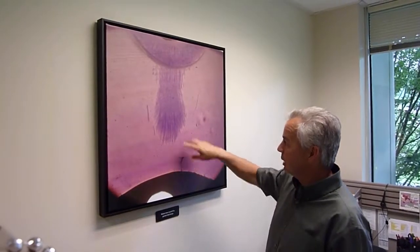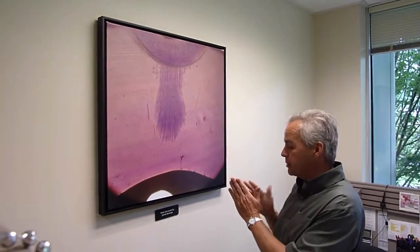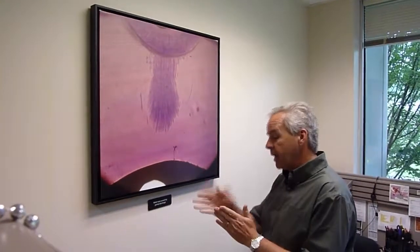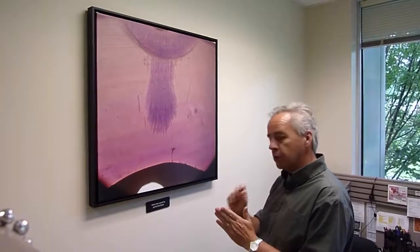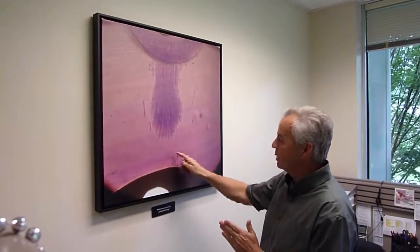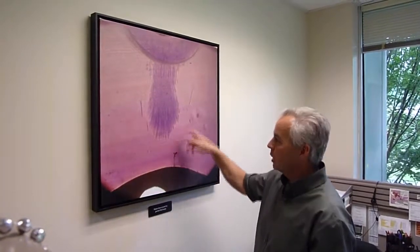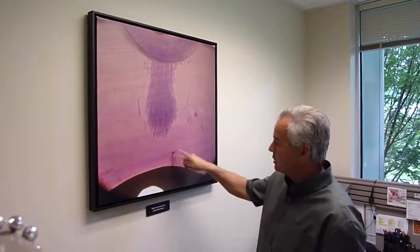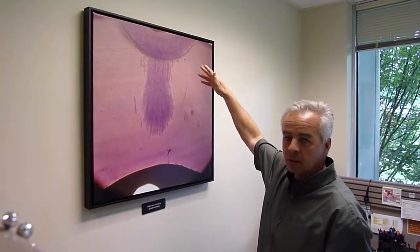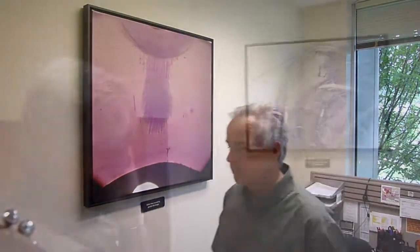So the electrical tree, unlike the water tree, is an actual channel. If we got up closer with an electron microscope, you'd see a worm-like channel through there, and that's from lightning bolts. Small lightning bolts called partial discharges going off inside there, and each time a lightning bolt hits the end, it melts or decomposes the insulation at the end, and it grows longer and longer. So these electrical trees, once they start to form like that, propagate through the insulation in minutes or at most a couple of days. So it's a very, very fast process.